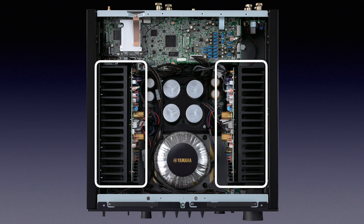To both sides are the power amplifiers for left and right, mounted against large cooling profiles. The amps deliver 90 watts over 20–20,000 Hz into 8 ohms and 145 watts into 4 ohms. When measured at 1 kHz and 10% distortion as some manufacturers do, it delivers 120 watts into 8 ohms and 185 watts into 4 ohms. The really usable spec is 90 watts into 8 ohms and 145 watts into 4 ohms over the entire audio band.